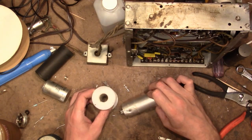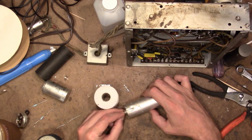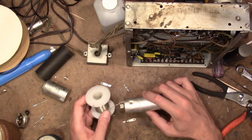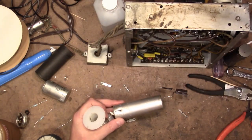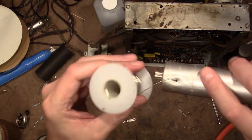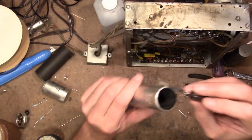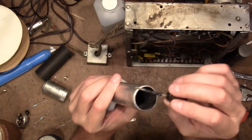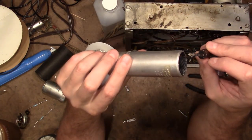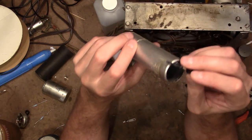Here's what I came up with. I realized the larger hole would help, and since I was going to solder the wire onto it I wanted it recessed so when I put on the cardboard insulation it's not sticking out. I stuck a small screwdriver down into the hole and whacked it a few times to leave a dimple, which will serve as a little solder cup. I ran some bus wire through, attached the negative lead, attached a positive lead to my new anode, and put some heat shrink tubing around that and a little bit around the negative lead for extra protection.